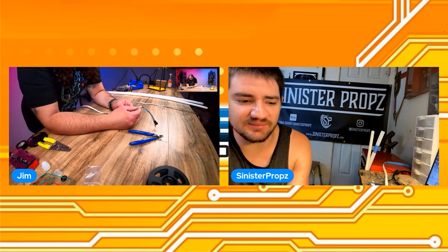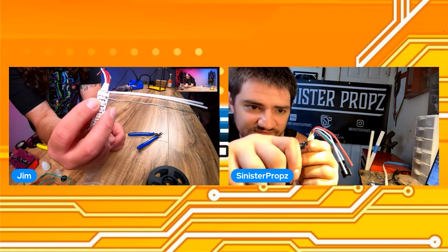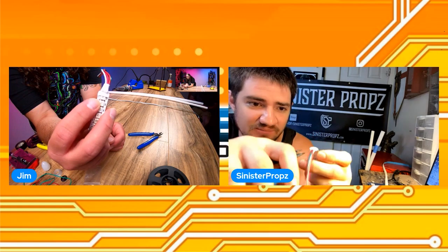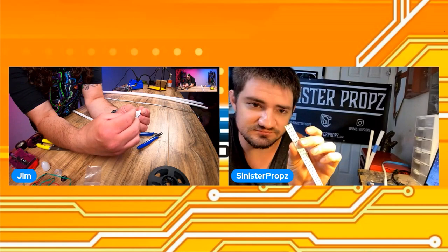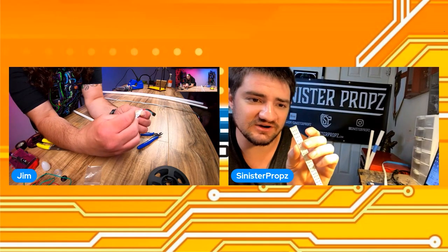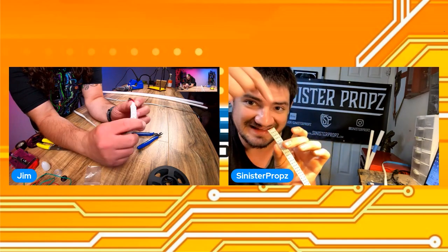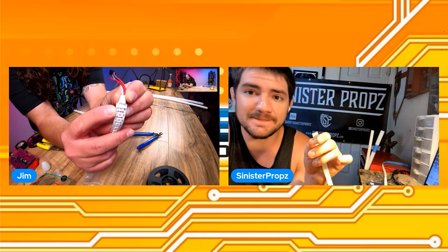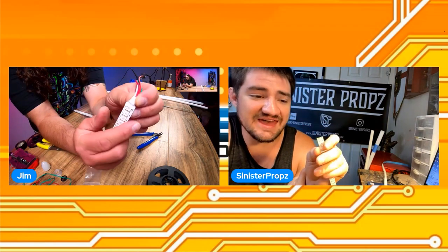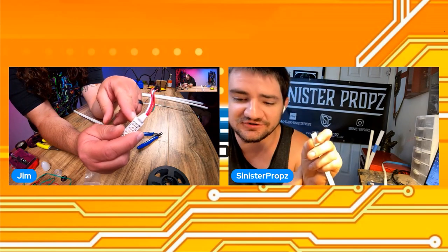Follow the arrows to the top. You're going to find the top. Just go towards the top and cut the top wires off. I don't know what you mean by don't cut the bottom of the arrows. If you follow the arrows all the way up to the top of the strip, you're not at the bottom of the arrow, you're right at the top of the arrow. Cut the top of the arrows. So peel this shrink back and cut the top? You don't have to peel it back. You just cut it at the first available NeoPixel.